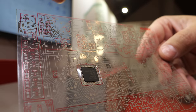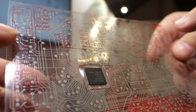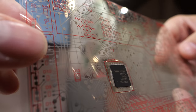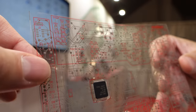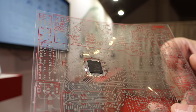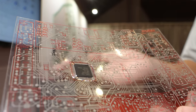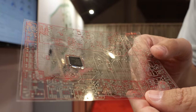All these lines and dots — could they actually be functional? That is correct. How complicated can it get? It's the equivalent of a four to six layer PC board. You can do down to five mil — five thousandths of an inch — space and trace. We can do the vias and build up multiple layers on one layer of substrate.